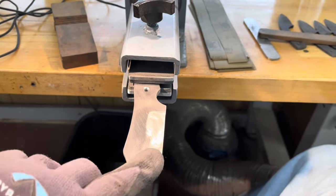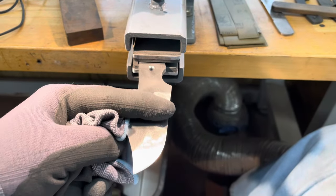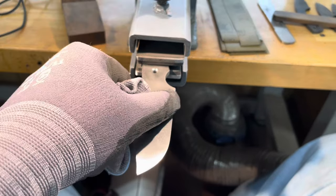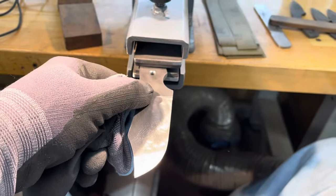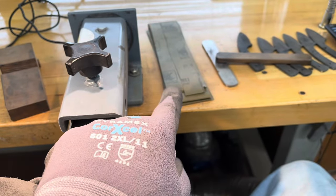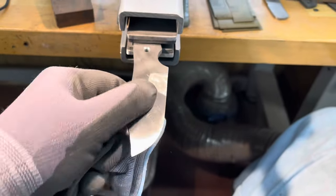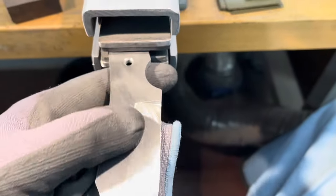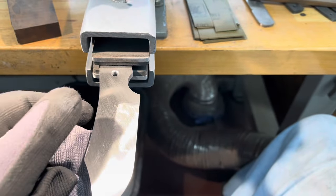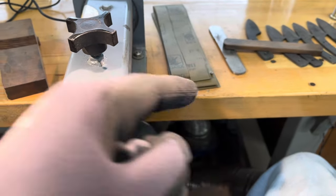I grind the bevels at 60 grit, and then I put a 120 grit belt on and I smooth them out and fine-tune the bevels and bring the bevel right up to my line that I scribe. And then I hand sand starting at 150. Well, that's 180 right now. 150 got all the grind lines and the imperfections and flaws that came with the steel. You know, surface imperfections, just visual flaws.